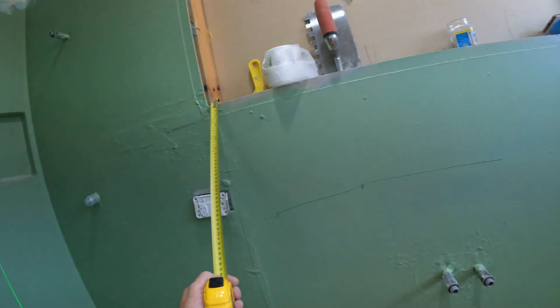I'm going a full tile off my strip drain. That line across there is going to be my shower screen — that's where it goes and that's where I break its back. Breaking its back means I'm going from there and it's sloping down to the strip drain, then that part is level. So it's all sloping that way down to the shower and it's flat out here. That's where the shower screen goes, which goes nicely up there.